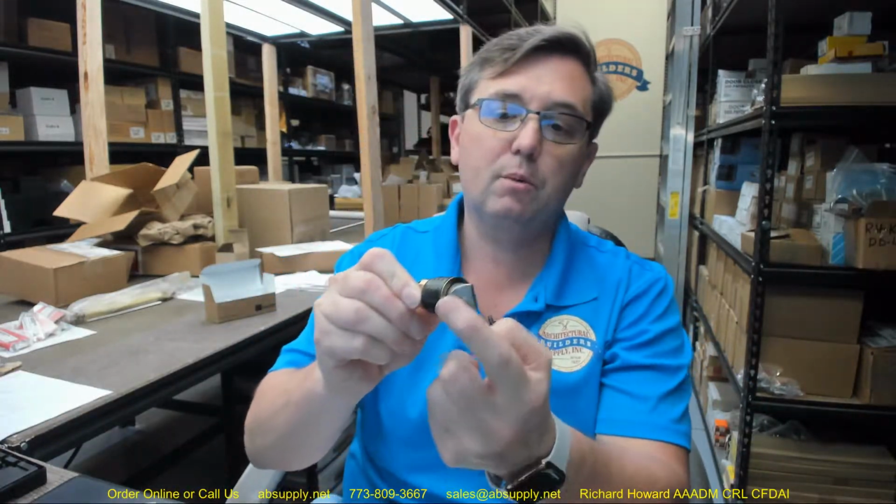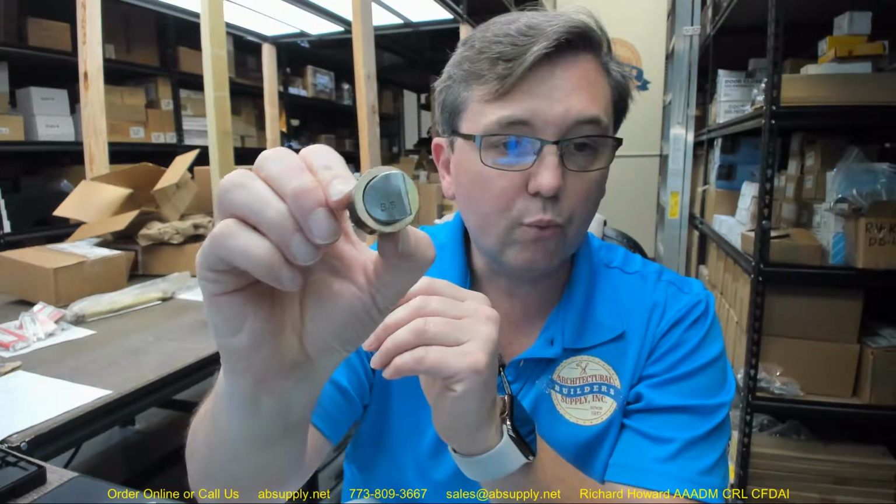Long-term effects of a drive-in latch, I would say, would not be advantageous, because pressure on the latch over time will ovalize the hole in the edge of the door. These are used in residential applications, so it's nothing anyone would really concern themselves with. But this is for a cylindrical lock, which in my opinion makes it fairly uncommon to see. If you're doing residential work, you're generally not installing cylindrical locks, you're putting tubular locks on.